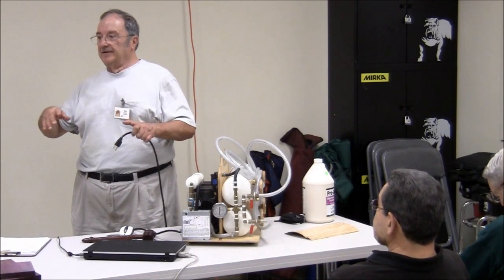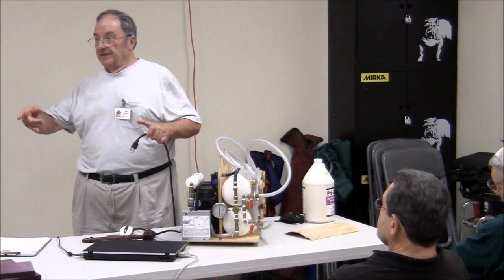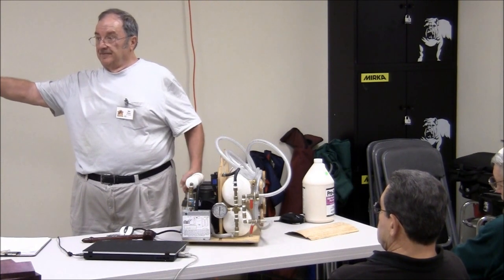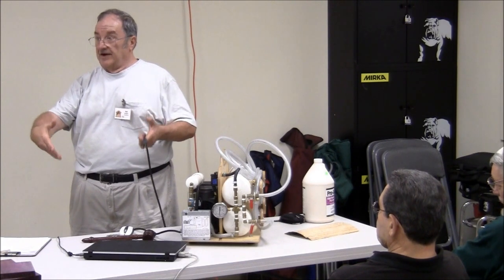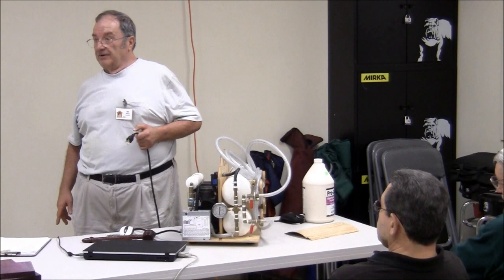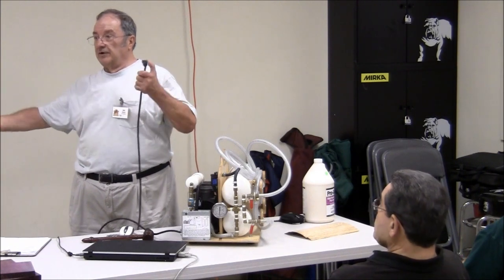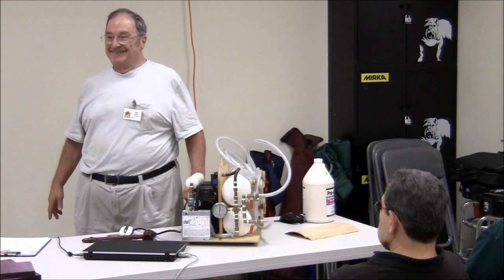You're almost right there. You've got two separate control systems working there. The compressor is going to run when it needs to replace the air in its own tank. You then have a separate control system, the vacuum controls, to control when your bag needs replacement. But I could leave the room and it would automatically do what has to be done. Both systems are going to run independently, and they play nice together. Okay.